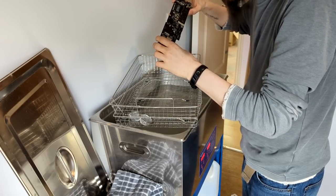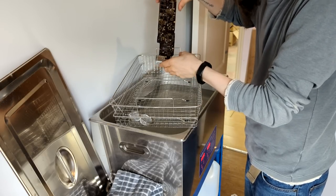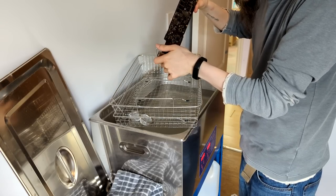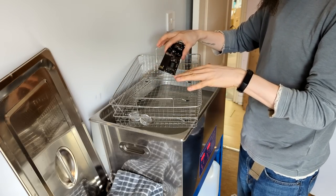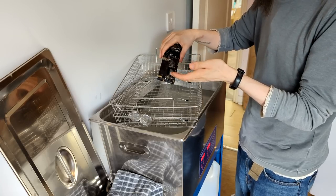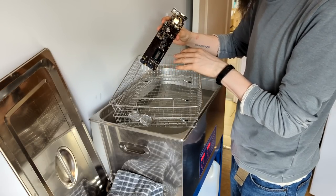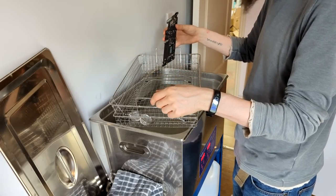I might actually quit while I'm ahead. Yeah, I'm gonna do that. The backside was actually in pretty good condition. We didn't see any corrosion or anything. I think just one side is gonna be plenty good enough there. The thing about ultrasonic cleaners is going in for too long will do more harm than good because you're just boiling the circuit board at that point. I've learned from my experience not to put it in for another round just for the sake of it. It's not like brushing your teeth where they'll only get cleaner. You will just start boiling the board away.